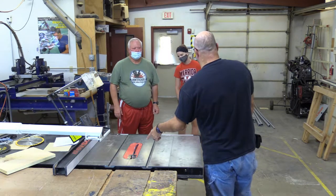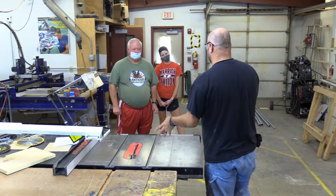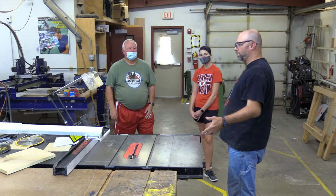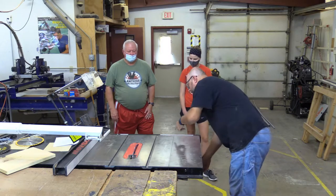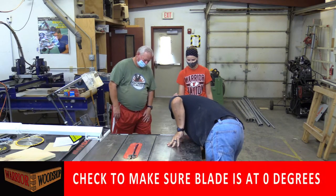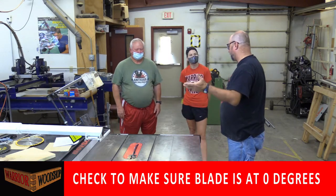You won't notice the 89-degree cut. They're not going to notice it until they try to assemble it and they have a gap — which in our class could be weeks later, because we only get an hour or two at a time. You've ruined the piece of wood. So what should you check if somebody else used this before? You should check it and make sure you reset it back to zero. Awesome — it doesn't take much. Because that prevents some headaches.